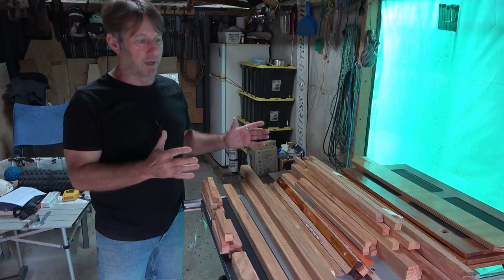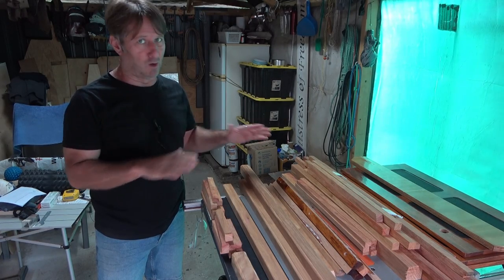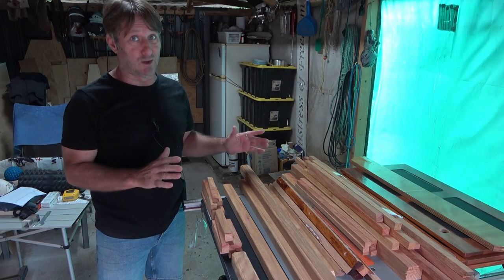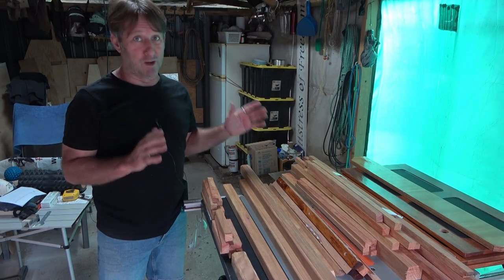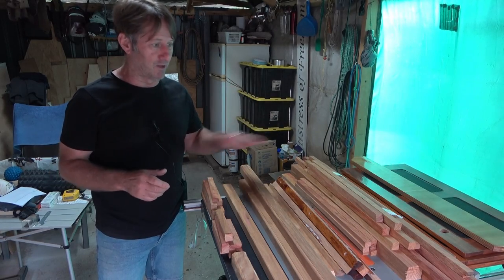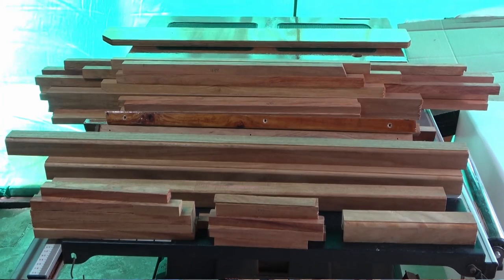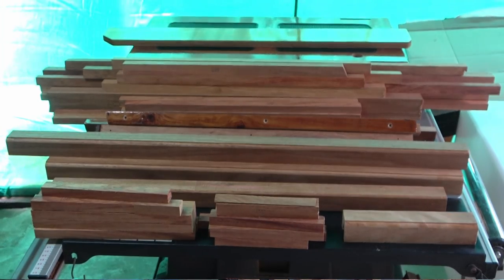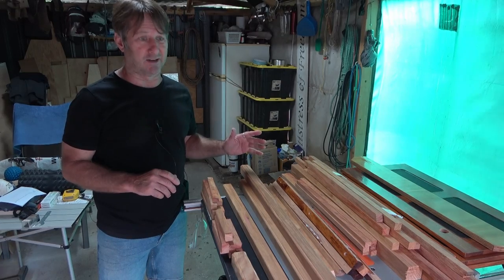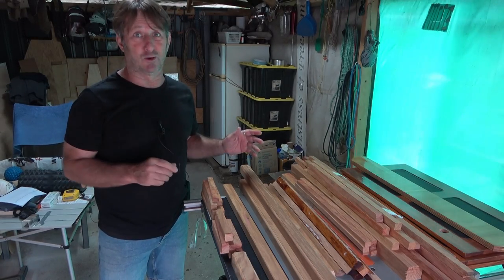This is the next batch of good rosewood for Mistress. It's going to be doing a lot of different things, and it probably doesn't look like a lot to you guys, but it is a lot when you consider all of those four edges and the ends on everything. I need to now get all of that sanded. First of all, with the orbital sander, then edging with the trimmer to take off all the sharp corners, and then hand sanding all of that before I can epoxy coat it. So I'm not going to put you through all of that.